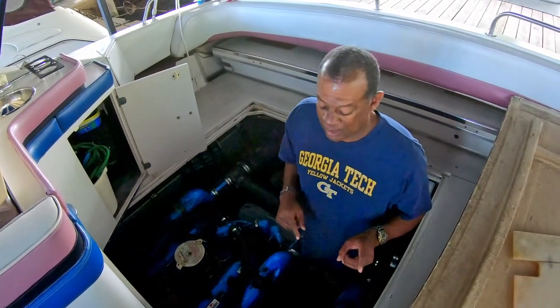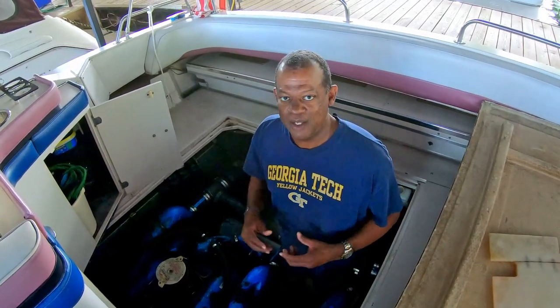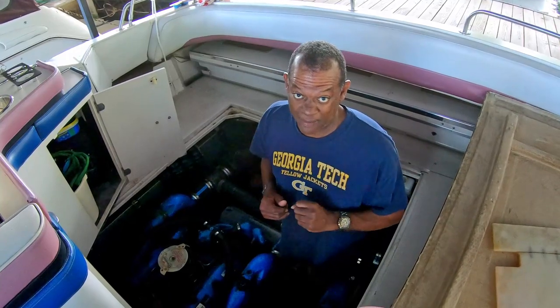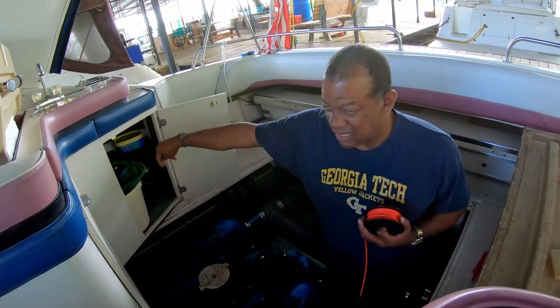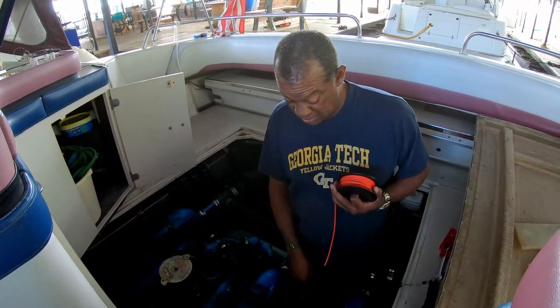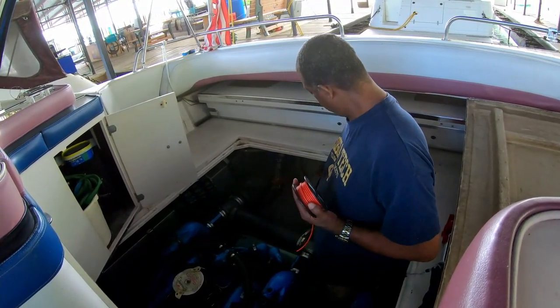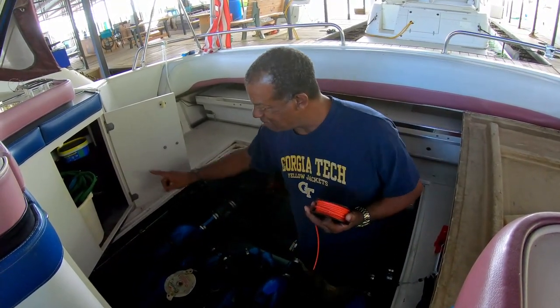Before we get started, the first thing we want to do is make sure that we disconnect the battery. As we're doing this, we don't want the battery to be connected — we don't want the system to be potentially charged and end up creating sparks down here. So the battery is disconnected. Now I'm going to take my wire, fish it down inside the cabinet, down into the engine compartment, and find a nice safe path to run along to get to the battery itself. Then I can set my terminals up and secure it — that'll be one side of the switch. The next thing I'll do is run another wire from the solenoid up to the switch as well, then connect everything together.